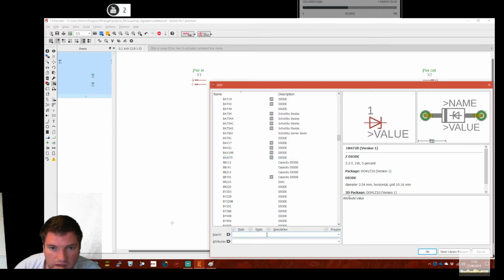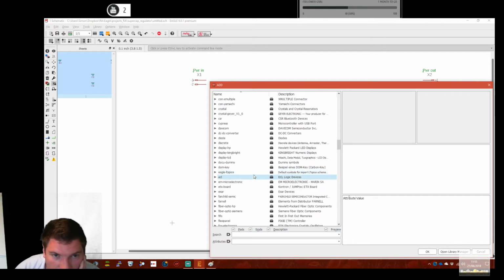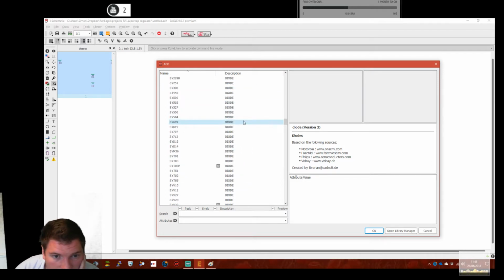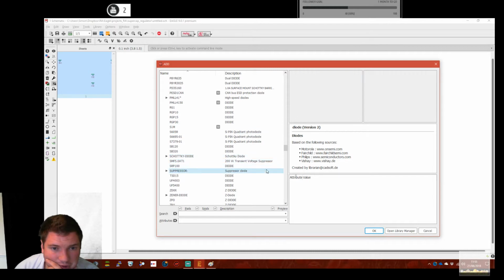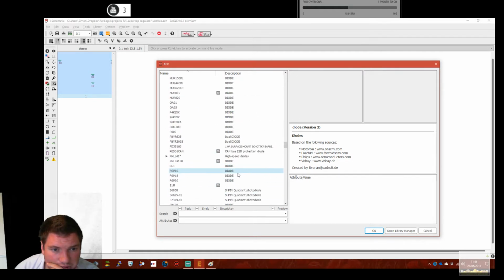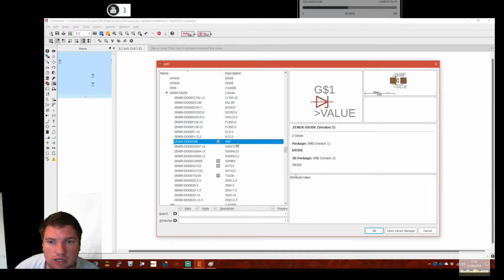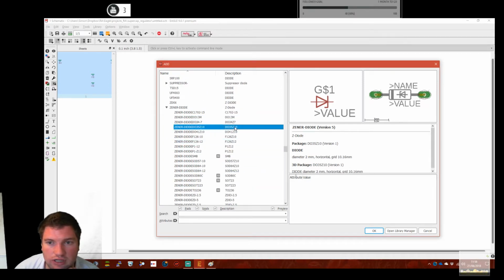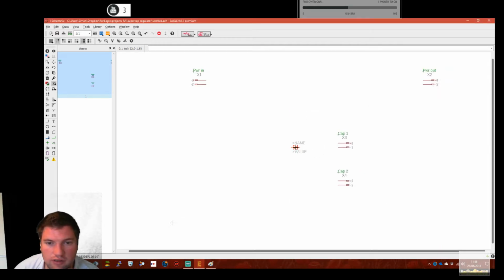Let's use. Right, let's not. Search in Eagle. Utterly diabolical. Oh, they call it a Z diode. Yeah, per diode. Zener. See the Zener. Why didn't it come up in the search? It's a poo. I don't know. It's going to need to be beefy because it's probably going to need to take a bit of current, particularly if I'm farting about. So, well, let's do that for the time being. So we're going to have a protection Zener across each.